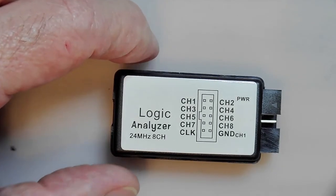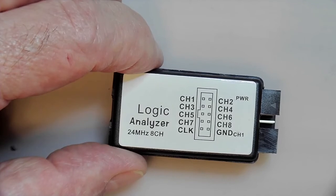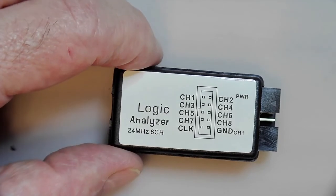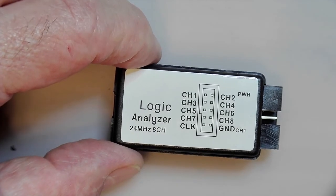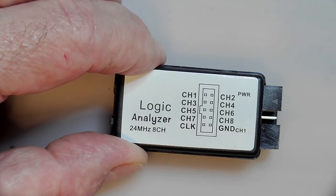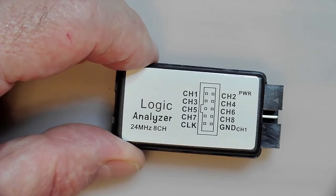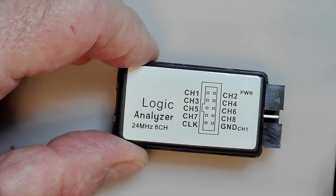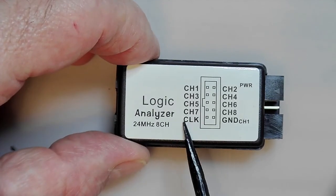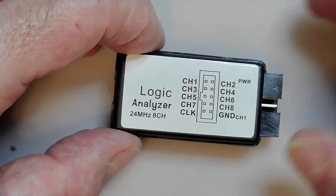When I hook it up to the oscilloscope, it's got a triangle wave on there, around 2 megahertz or something. But when you hook it into something with a lower impedance, the signal changes, the frequency changes, and it's not a triangle wave anymore, it becomes some strange distorted wave. I have no idea what that is, but in any case we've been using the ground and channel 1 to 8, and it's been working perfectly with that software, so I'm not too worried about that. I might investigate where that goes one of these days and see if I can work it out.